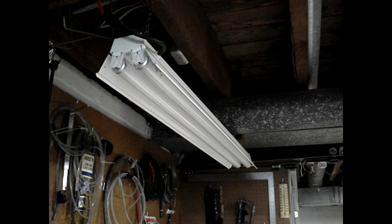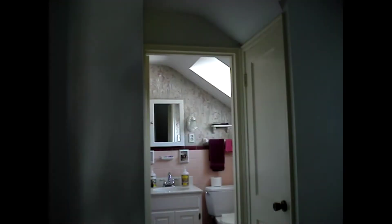Fluorescent lights can cause interference — install at least 12 inches away from them. Do not mount in high humidity areas; many codes require a minimum of 3 feet away from a bathroom door that contains a tub or shower.